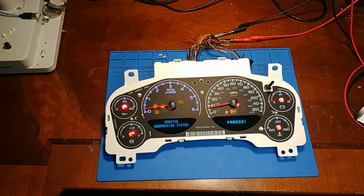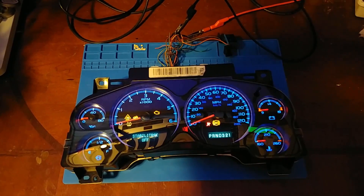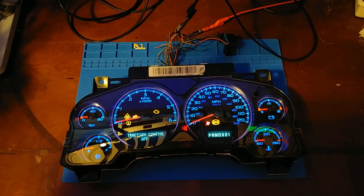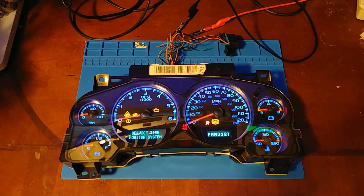I'm just going to finish this guy up — this one's all wrapped up. A couple things to note: try not to be tempted to buy the super cheap LEDs through eBay from Chinese sellers — you might kick yourself later. I'm using a King Bright brand, which is at least a fairly decent, reputable LED, and I'd expect these to last the life of the vehicle and then some. This probably isn't quite a do-it-yourself job with the LED install. While a microscope, hot air station, and two soldering irons aren't required, they sure do help. If all you have is a hardware store soldering iron, I probably wouldn't recommend attempting this — send it out or practice on a practice board before you go at your cluster. That wraps up this one. Thanks, guys. See you next time.